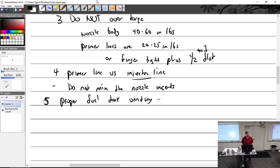Going back from the Shasta area, that wing looks all wavy. We switched tanks and landed, and I had a mud dauber up in the vent line. You guys heard of mud daubers? It's a big deal. I don't know if it's just the valley here, but it's a problem here. I don't know what they look like, but I know what they leave behind. Some people call them leaf rollers. It's some sort of bug that takes little pieces of leaves and goes inside very small tubes, pitot tubes especially, and builds these nests inside that you just can't get out. I had to get one out of a plane one time, and I had shop air at 110 PSI, and I'm just holding it going, dang, I can't believe the air won't go through. All of a sudden, it's pow, and it hit the clock on the wall. It's out now. But yeah, you got to watch those.